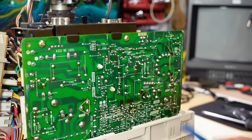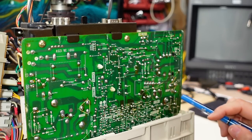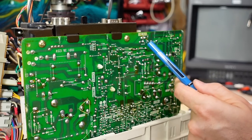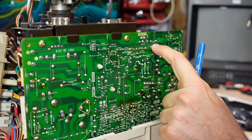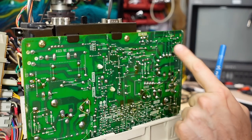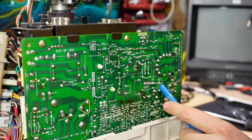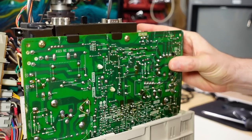Taking a look at the damage, it's relatively extensive. There's a trace that comes up and it's broken right through. There's a trace that goes to a leg on the flyback and that is broken. Pin seven goes over to something and it's broken there and there. This trace is broken right there. There's a trace from this diode that goes across the crack and there are multiple breaks. The crack also goes over here and might have broken another trace. So yeah, this thing suffered some serious trauma.